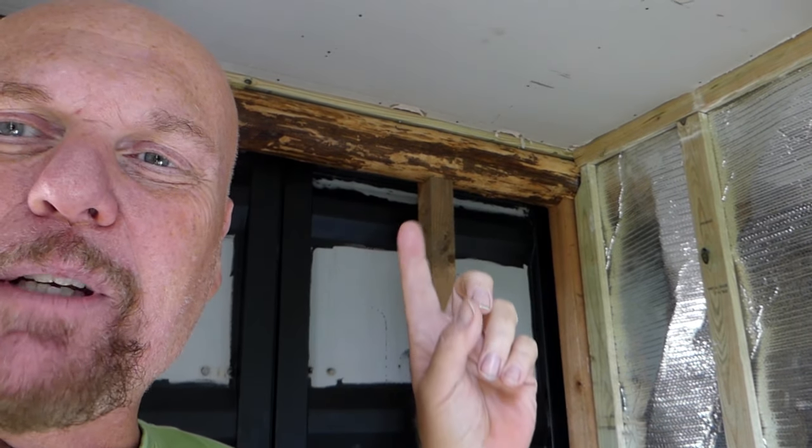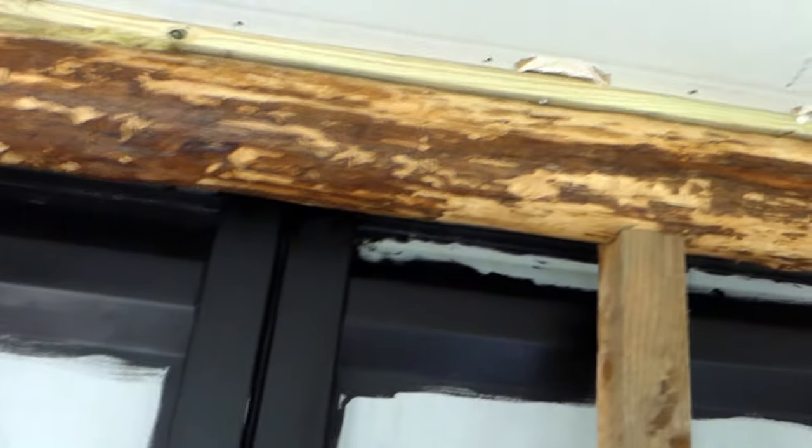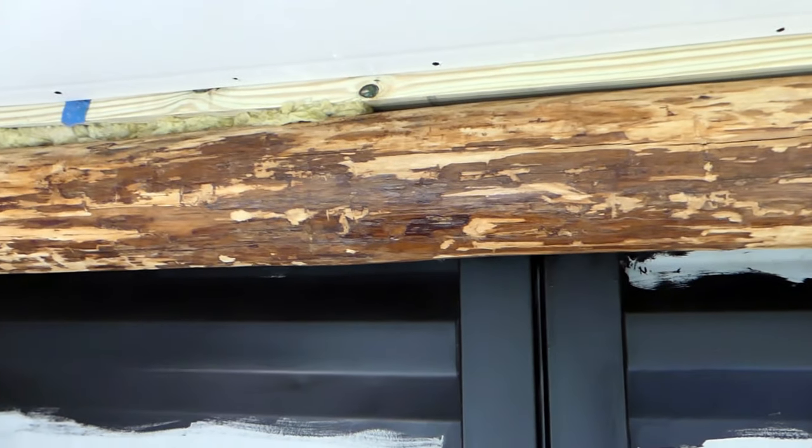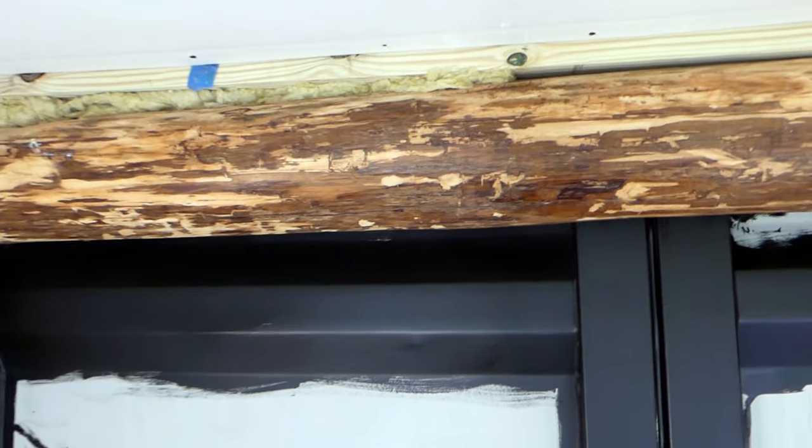The simplicity of values in a modern home is in repetition of lines. Here you see I've got a rustic beam exposed, and I'm at the point where I can make two decisions. I can cut a piece of trim and carve that out to leave a nice linear edge. But I've decided I prefer to accentuate the flaw, which is the taper of the log. So I'm going to cut a piece of drywall that'll follow along the edge of the log and expose the natural live edge. That takes more effort in plastering, but I save time by not having to chisel it all out or cobble together and cover it with a trim piece.